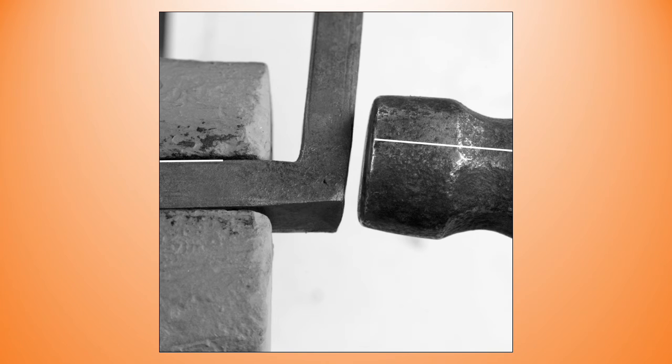And this looks better. This is my corner. It's open of 90 degrees. The center line of my hammer has not progressed past the inside edge of the opposite bar, and I haven't gone too far in extending the flat to the bar. The only thing I think I need to do with this corner perhaps is claim some of that increase in width.